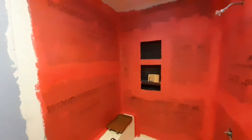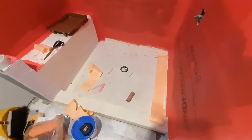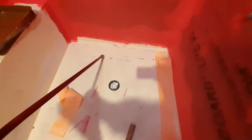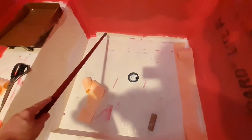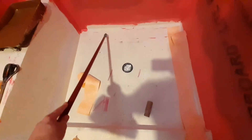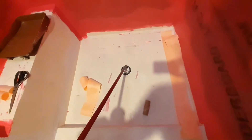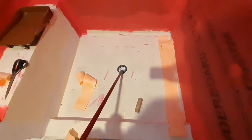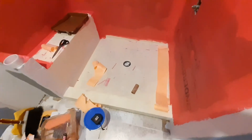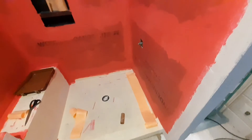I got underneath the house yesterday and connected the plumbing. The old plumbing came through right about here and I've got floor joists at two-foot centers. All I had to do was patch that hole, come over about seven inches and toward me about twelve inches, and drop my new hole there. I redid the plumbing and the new P-trap, so the plumbing is done — I just need to finish painting and waterproofing.